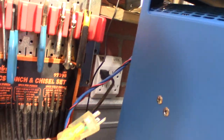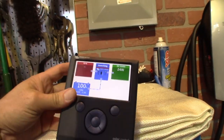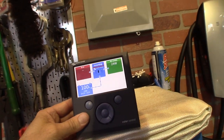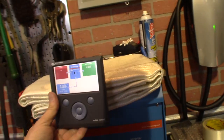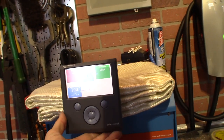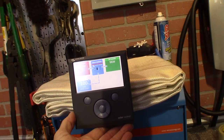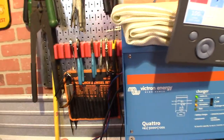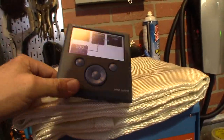If we look back here, I'm going to unplug the primary, which is here. And remember, we're limiting the current on the secondary. Now, right now, it's taking the batteries and inverting them. And in just a second, it will switch over. And we go right back into absorption charging, and it thinks we're running on the generator. Basically, the generator is just a smaller cord off here, but we've limited its input to 15 amps.